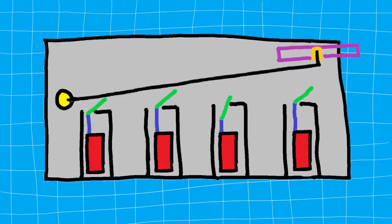As you can see, there are a few things to explain. The bottom half of the picture shows 4 red pins, and attached to each of those pins is an arm. Let's take a closer look at one of these pins when it is set in a low position. You can see the attached arm is kept at an upward angle. This sticks up, which keeps the long locking arm in an upward position, which in turn keeps the bolt in place. If we now raise the pin so that it's set too high, we can see that the arm is no longer in an upward position, but the locking arm is still being held in place by the pin itself. Only if the pin is at the correct height will the locking arm be able to come down and allow the bolt free movement.